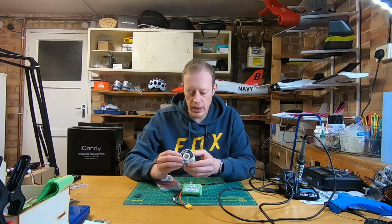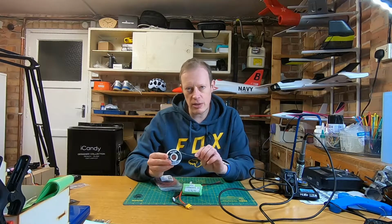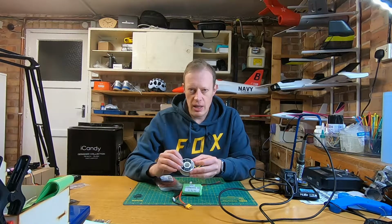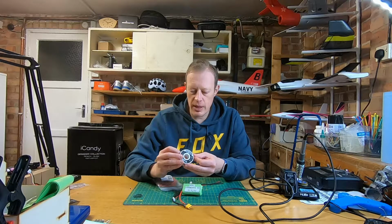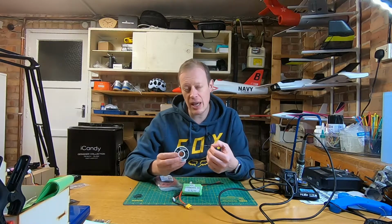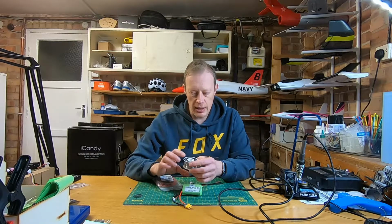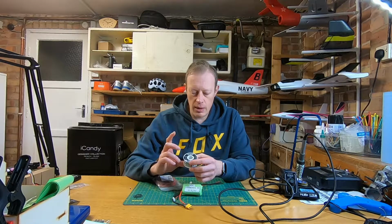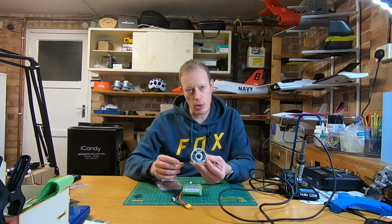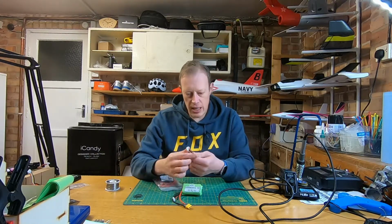And then solder is the other big thing. Obviously you need solder, but it's what sort of solder. And you really need to use leaded solder, because the stuff that you can buy from most places these days doesn't have lead in, and it doesn't stick very well, and it needs higher temperatures to get it to melt. So this stuff's way better, and to be honest, I'd recommend this for any of the soldering work that you do with your planes. I'd get lead solder if you can, and it's easy to get hold of. A lot of the model shops sell these, particularly like flyintech.co.uk, and this is Team Black Sheep solder. This is lead solder, and this is really nice to use. So that's pretty critical.